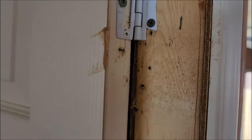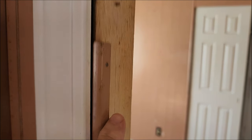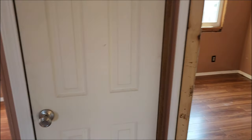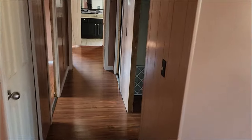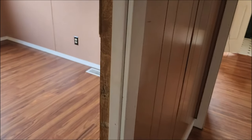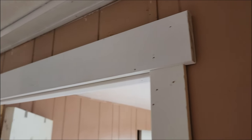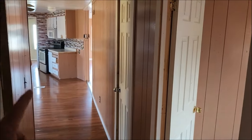This house has mobile home doors - they're about the same thickness as a regular door but how they're hinged and molded means I'm going to end up rehanging just about every door in this house. Then we'll figure out how to trim them with stops and casings and redo all the moldings into a craftsman style. Look at this one - there's a nice gap on the top of the door. The previous owner started working back here and redid these with half inch casings and door stops, but looks like he ripped it to width. I do like the header style but we're going to have to fix that.